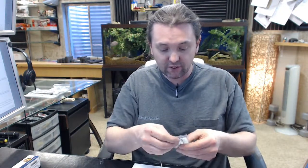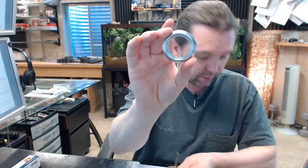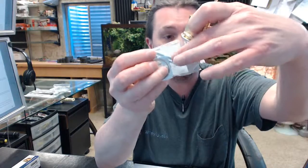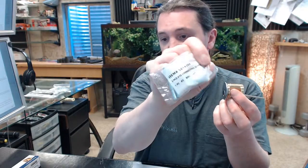A standard package of a rim cylinder from Kaba Ilco is going to include the cylinder ring. Sometimes that's used, many times it's not because the application doesn't allow it or require it. You'll also get your retaining cup that will go through the door, and then of course the 2 breakaway screws. And those are breakaway. You would cut those, you wouldn't try to snap them, because those screws will accommodate a very large, thick door. You may not need to cut those whatsoever, but it's likely you're going to have to nip them off at the first graduation mark there. Every rim cylinder will get this material.